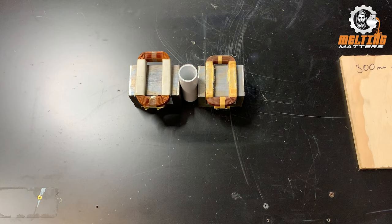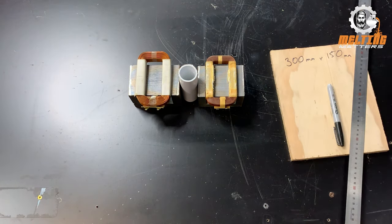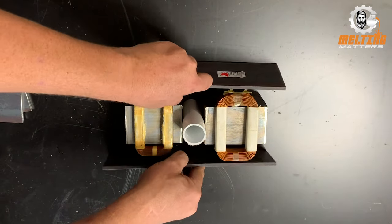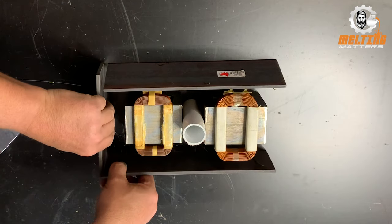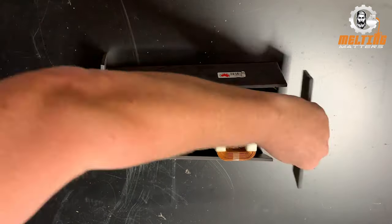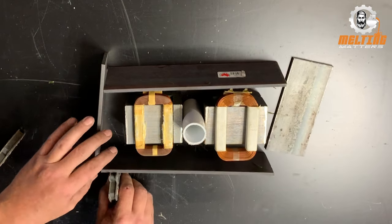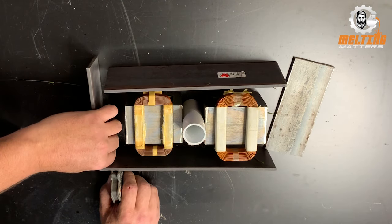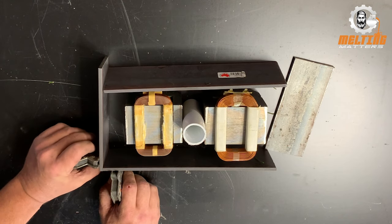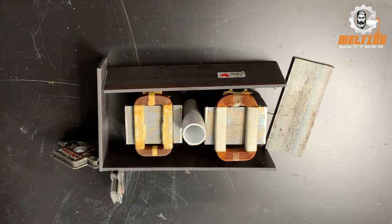I'm measuring out the size of my frame — I'm going to be using a mild steel frame, 5mm thick, just making a square frame at this stage. I'm not worrying about attachment points at the moment. Probably in the future I might tap a couple of holes and put tabs in to fit the slots of my drill press, but for now I'm going to be using it more as a grinding magnet so I can put a piece of metal on there and use the magnetic force to hold it in place while I grind.